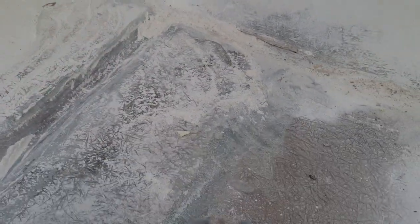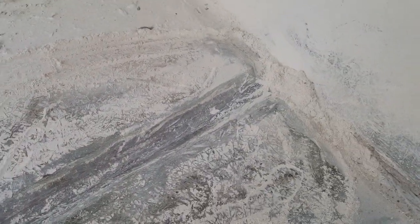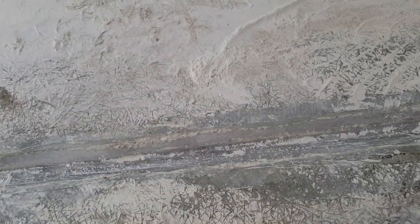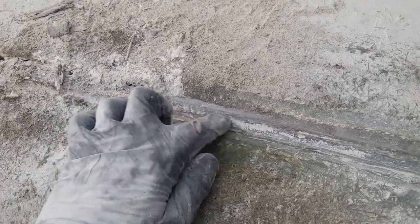We've done some solid grinding. The big question is how much do you need to sand? Number one, you want to get all the wood out — any old wood left in there will be a problem when you add new stringers. You'll also see certain parts that are delaminating; they have a lighter color compared to the darker areas. You want to try to get that out as well. There's some leftover chop strand hanging around — that's not a big deal.